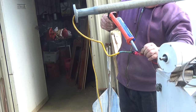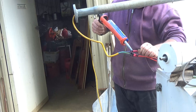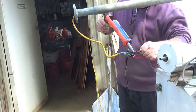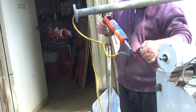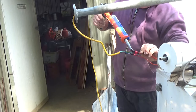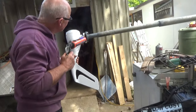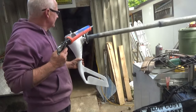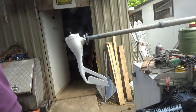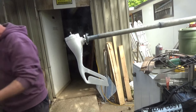I'm going to liberally coat these joins with silicone, and I'll put a knot in the wire - bundle the wire up over the joint and tape it together - so that the connectors aren't carrying the weight of the cable down inside the pipe. Now I'm going to put one bolt in loosely, fit the other three, centralize the thing, and put a bead of silicone around the base so that water can't get down the pipe. Then we can put the blades on.